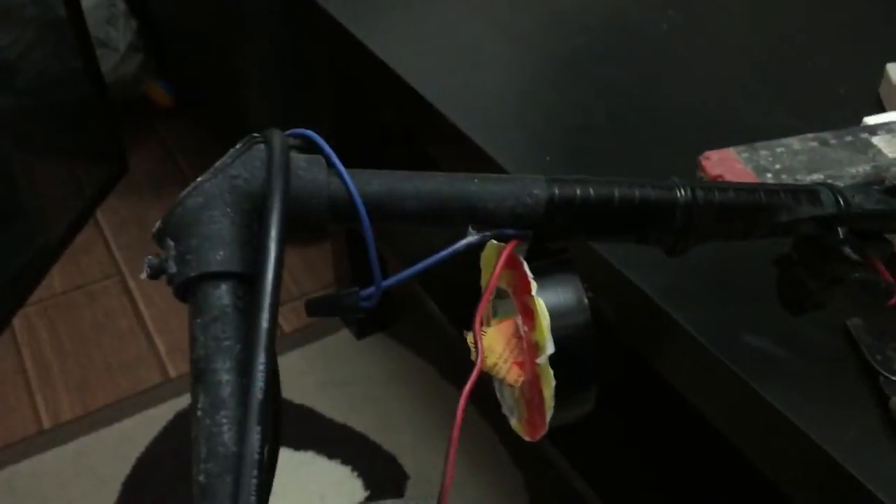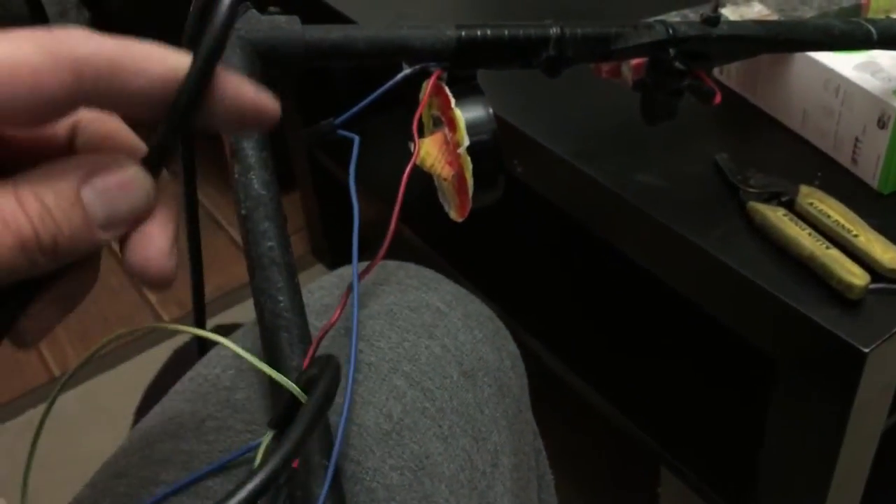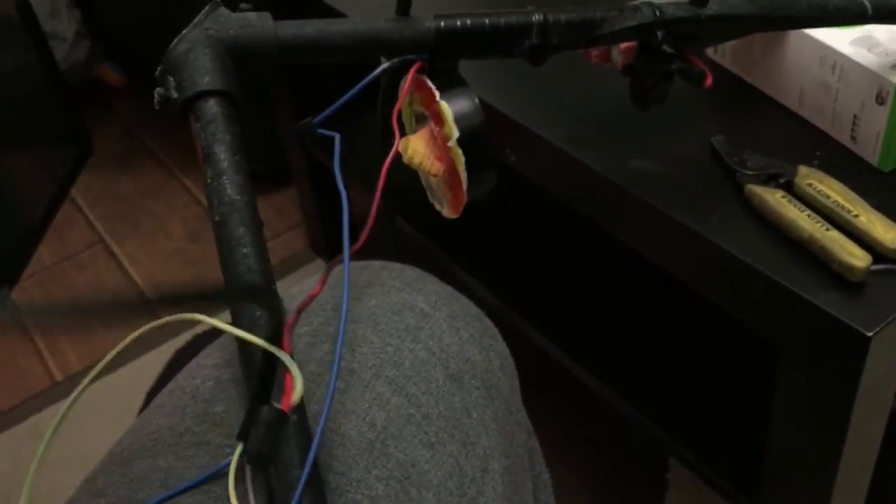The next part I'm going to do is wire it and then wire the controller. I'm just finishing the wiring here for the T5s right now. They're just like a fluorescent with the ballast. I'm making the final connections so we can wire to the Workhorse 7 ballast. I got my sockets put on and I'm finishing up the wiring. I put a nice corded end — it's going to go up through the canopy and to the Workhorse 7 ballast.